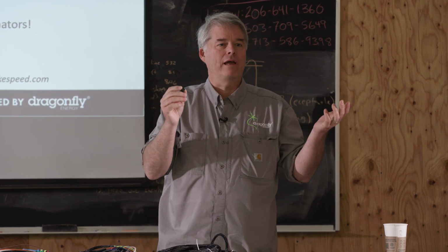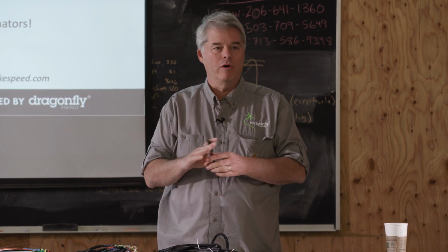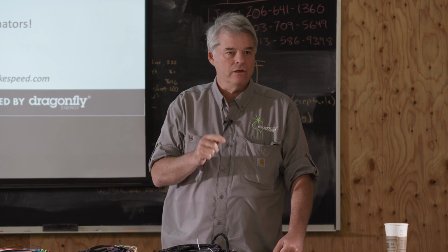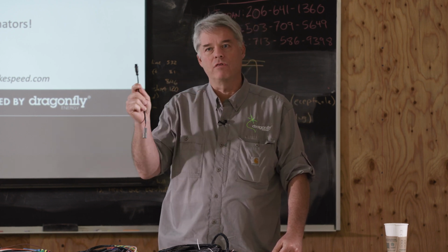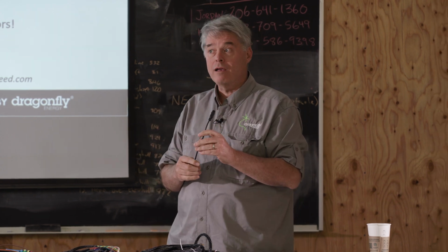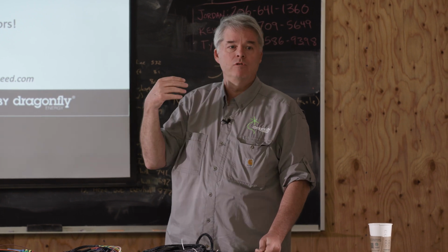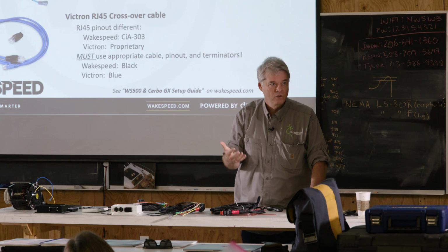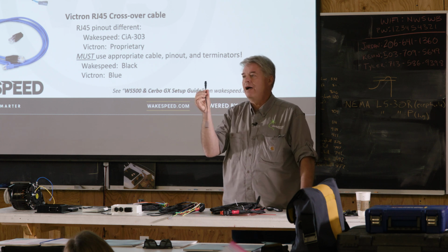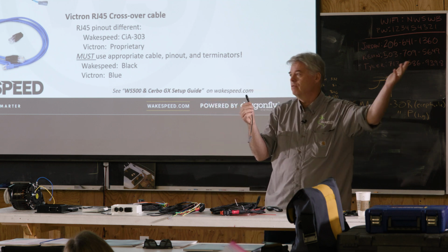But now, with Dragonfly, we are full members of NMEA. I actually sit on the NMEA boards and such. So we are moving our nomenclature in our documents to say NMEA 2000. That's what this connector is. But if you find some old Wakespeed documents, you'll see it called an M12, or sometimes you'll see it called DeviceNet. This wiring standard was originally defined under a DeviceNet standard, and NMEA adopted it for their own use.